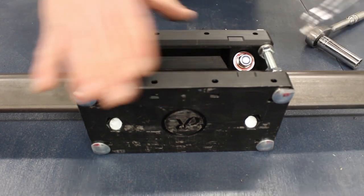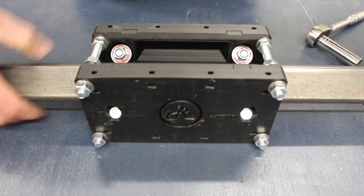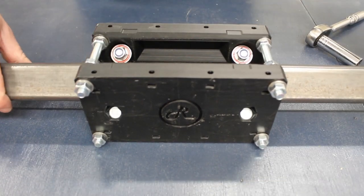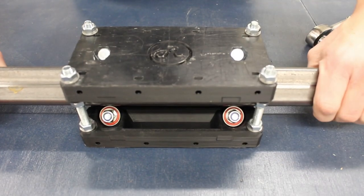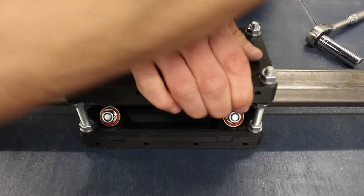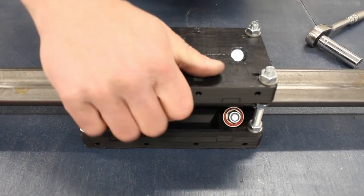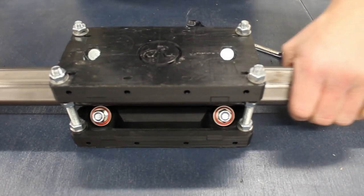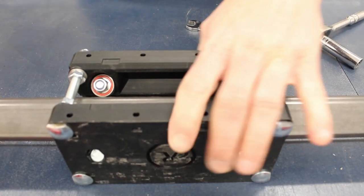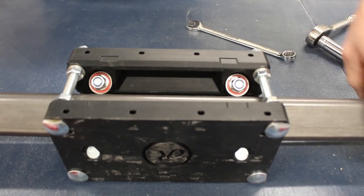You can see me putting the opposing nuts against the carriage block. This is so I can tighten against. As you can see, it takes a bit of trial and error to make sure the box section runs smoothly and sits snug within the carriage blocks. Take your time, go around the corners and make sure the nuts and bolts are correctly tightened. The carriage should run freely and consistently across the whole length of the box section.